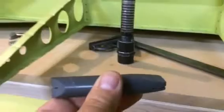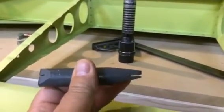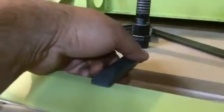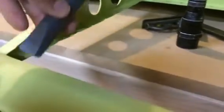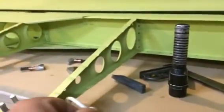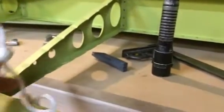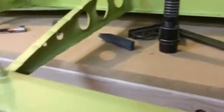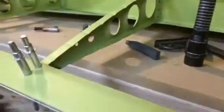What I did is I took my bob stick — my version of the bob stick — and you can see there's a slot cut in it. I just stuck it on here, bent it down, and pulled it along, and kept working it back and forth. When I was right up against the edge and couldn't get in there very well, I took a piece of rope, tied a couple of loops in it, slipped one loop around the tool and the other loop for my fingers to pull. Held it down with one hand and pulled on the rope with the other, and I was able to pull it away from the edge and get it going. It is working out much better than even I thought it would.